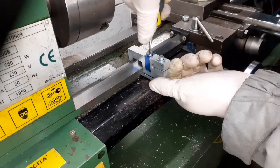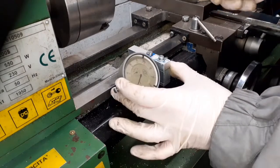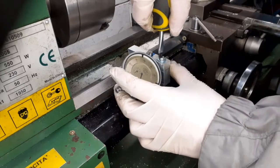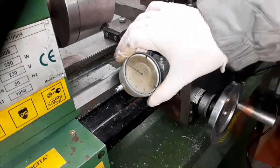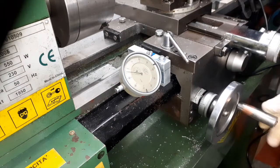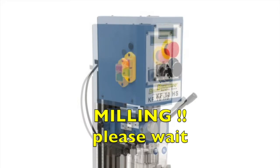It's very steady. You put the micrometer here and clamp it — it has to be not too tight but blocked. Now you can set the position of the carriage, zero the micrometer, and you're ready for turning to a shoulder.